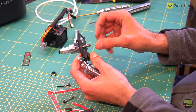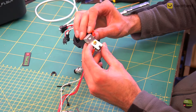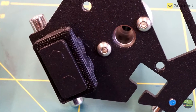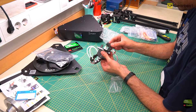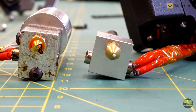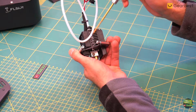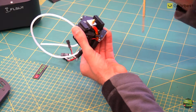So we just push it into the heatsink and secure it with two screws. The heat block is also a bit smaller than on the E3D. Teflon tube goes all the way through the throat up to the nozzle, and that's the way it works best for me. On the bottom we have a 3D printed part with a steel insert where we attach the leveling sensor with a magnet. I noticed a burned wire around the heater and filament inside the nozzle, meaning every head or entire printer is tested before sale. The steel cover protects hot parts and is used as a fan holder — one fan cools the heatsink constantly, and a turbofan on the other side cools parts during printing.